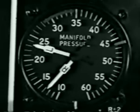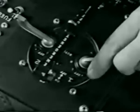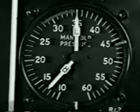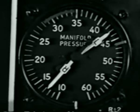Check mags at 28 inches, starting with number one. While you're boosting manifold pressure, you remember there's a backfire hazard during the mag check — so you check turbos off, waste gates open, just to be sure. Pull left. Don't watch the tach; watch the engine. Roughness doesn't always give you a quick drop in RPM. Pull right. Then throttle up to the stop, a quick check of manifold pressure, and then full turbo. Since you're using 91-grade fuel, you can't draw 46 inches — power's cut about 10%. Set your lock, check RPM — a little below 2,500 on this fuel. Back slowly on the throttle because of the induction backfire hazard. Same procedure on all engines.